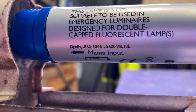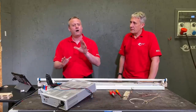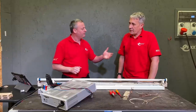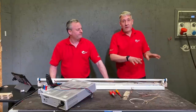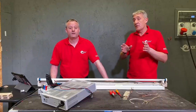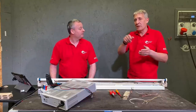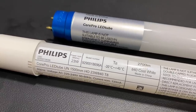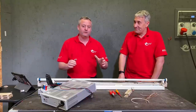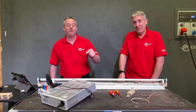There is one other thing to consider with the tube: the mains end is identified on the end of the tube, and that's the end of the fluorescent light fitting that you've energised with this conversion process. We also alluded in our other video to whether we can use a pack that's been changed to an emergency fitting and then do a retrofit. Speaking to Signify: on the datasheet and on the product it says not for use with emergency conversions. However, if you speak to Signify on a big project where you do need to convert emergency existing fluorescent fittings to LED tubes, they do have some solutions — just talk to them, and I'll put a link below where you can get in touch with Signify. Across the two videos looking at the Philips CorePro LED tube from Signify, we've demonstrated with little intervention that you can save a lot of money.